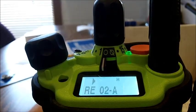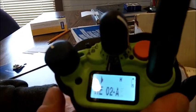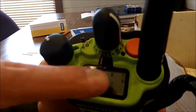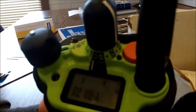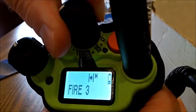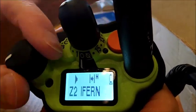The other buttons on top include another emergency button identical to the one on the remote speaker mic. You also have two non-rotary position switches that are currently blank — the fire department chose to have nothing on those particular ones, but they could be programmed for other features in the future. Above those is the channel select — it goes from channel 1 all the way to 16. These knobs are quite large, designed to be difficult to turn accidentally, and built for use with gloves.